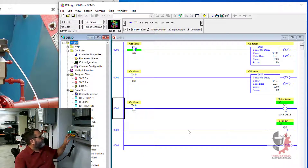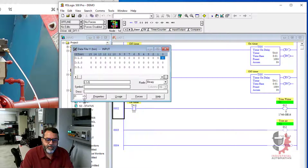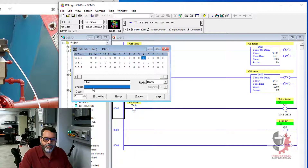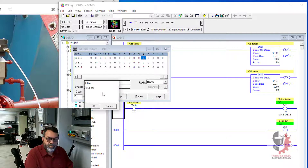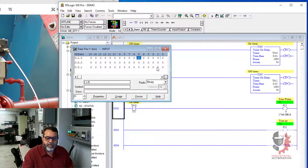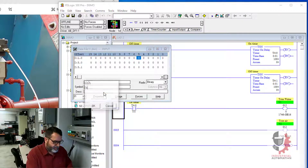Now I want something to control it with, so I'm going to use these buttons. This first one will be my pulsing water, and this will be my steady on. So I need a couple of inputs. This first one is wire four, so I'll set up B1 for button one — and I'll call that first stage cooling. And number five, I'll call it B2, and that will be my second stage cooling.